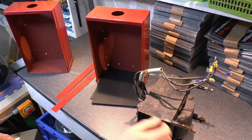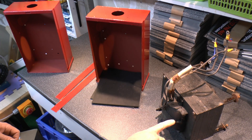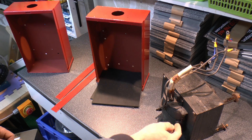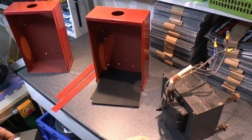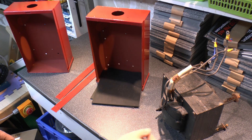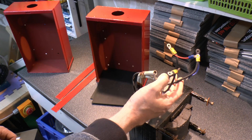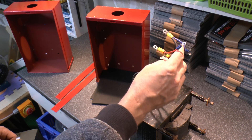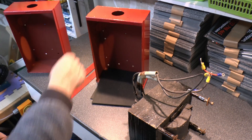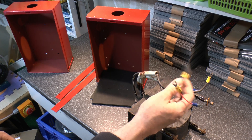These will come in some kind of varnish material as it is, so that's absolutely fine. Now on this side there were a couple of pieces here which looked like the end of some winding or something which had this sort of fibre insulation over. I've left the fibre in place and just put a bit of heat shrink over each just to secure those in position, because they were literally just slipped over. These are the three wires which originally went through the top of the case, basically through one of the holes here — that's the original connections, just marked appropriately so you can find out what they are.